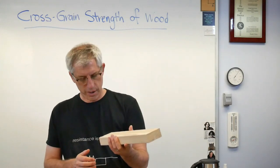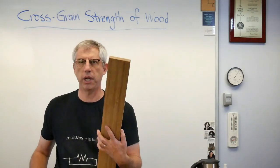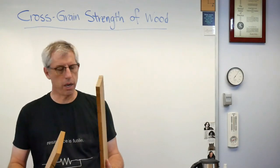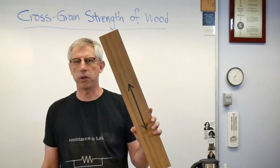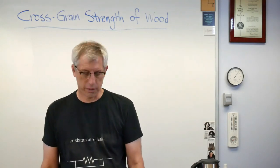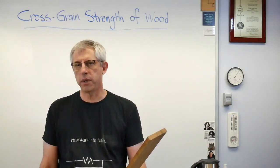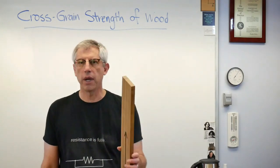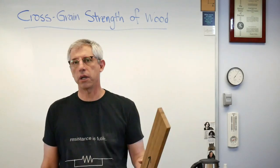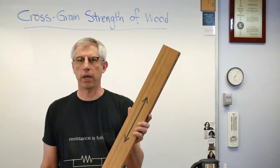How do you make that real? Here's what I did. I made two beams. This is a particular kind of wood called Lambu — it's a laminated bamboo product. You take bamboo, cut it into little strips, and glue it together to make this. It's a little unusual, but it's really well suited for what I'm trying to do here. It's extremely uniform and extremely strong, just a little heavy. When you cut wood from a tree, the material properties vary depending where you are on the tree. Lambu is a very uniform product, so I can compare two pieces and get less variation than with traditionally cut wood.